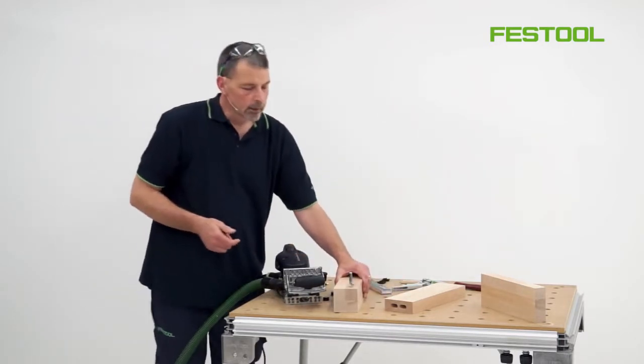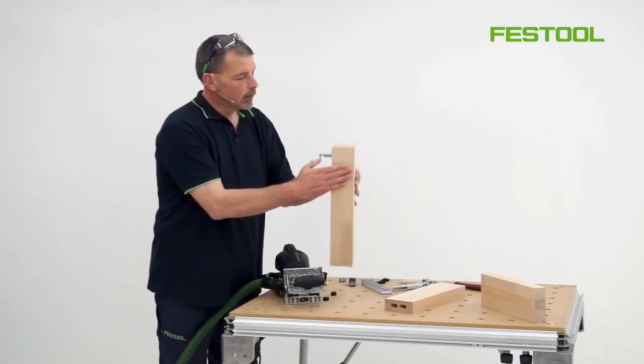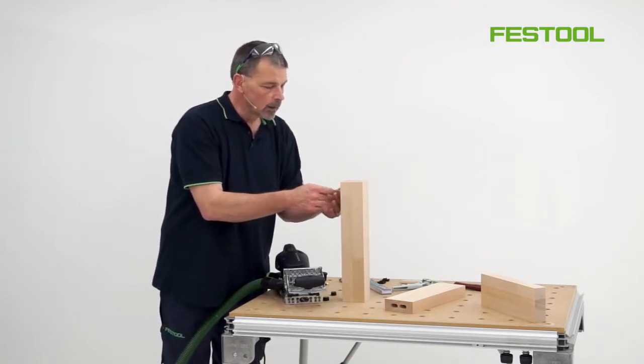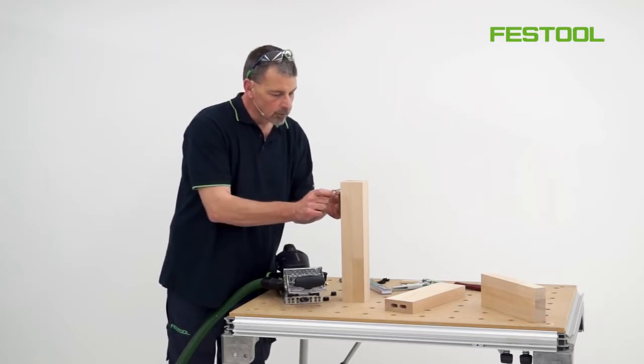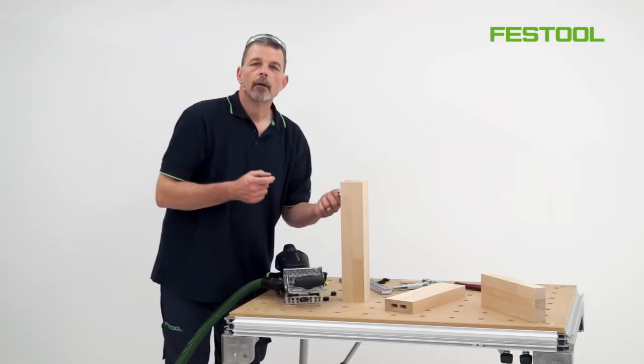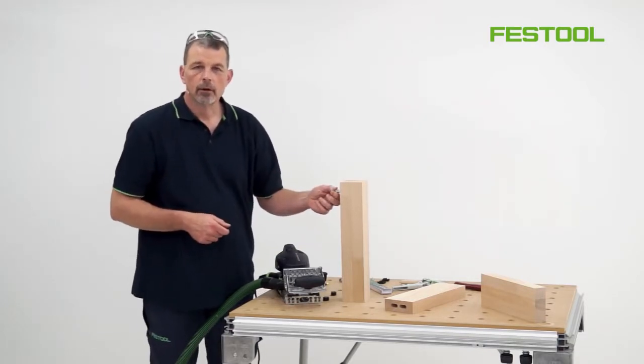And it's worth pointing out here that on the inside of the leg, there's a small recess section here, and this will be where, when the rail goes onto the side, we can have the access point. And by having this circular section here, the Allen key bolt will find its way into the slot.